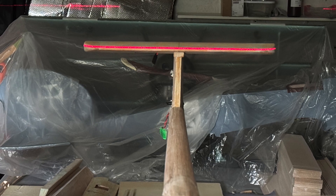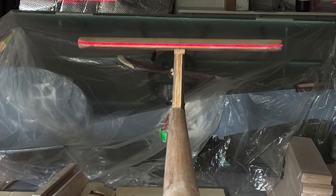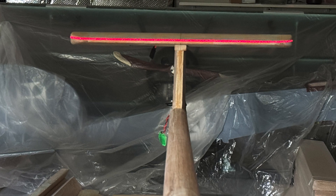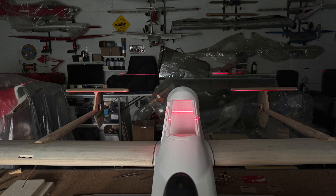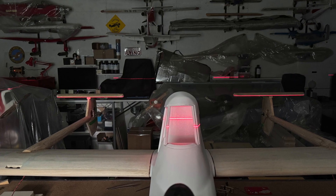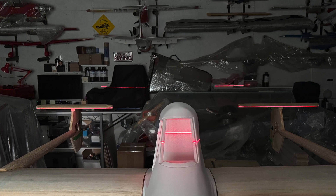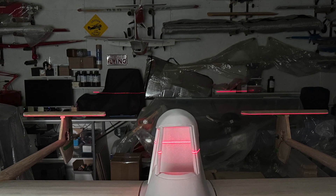When it came time to line up the various components within the airframe, in conventional aircraft we typically use a level, a measuring tape, a square, and different measuring points. However, this airplane isn't exactly typical with its two separate T-tails. I personally find a very effective and precise way is to use laser beams. Originally the laser beam was set up in the vertical position, and that's how the vertical stabs were lined up within the booms. Once they were secured, the laser beam was set up for the horizontal stab, and once I was satisfied everything was in the correct position, they were secured as well.